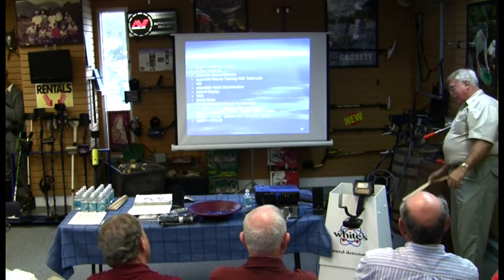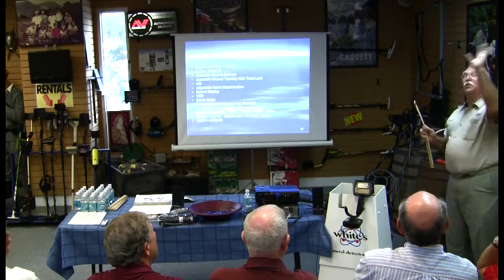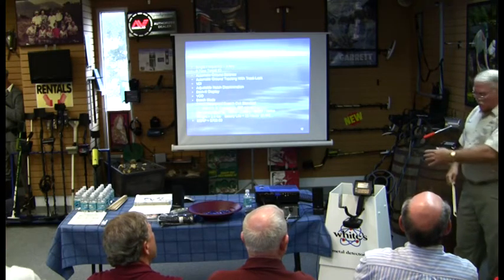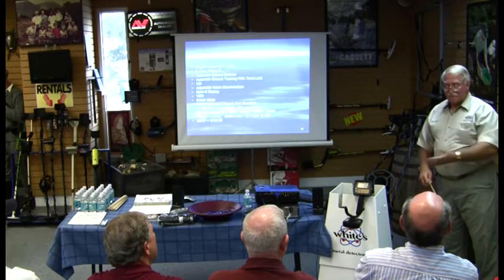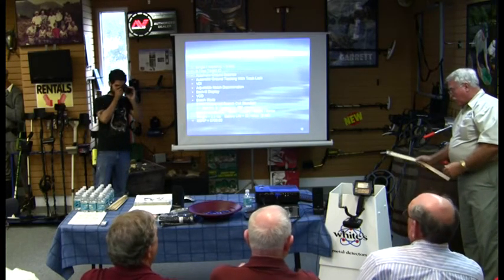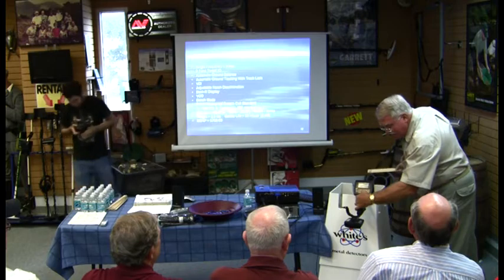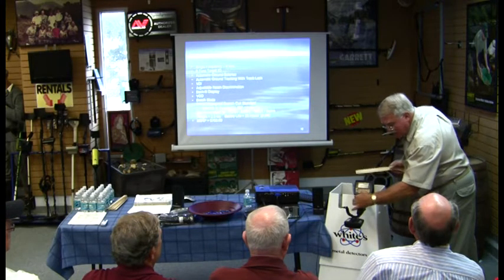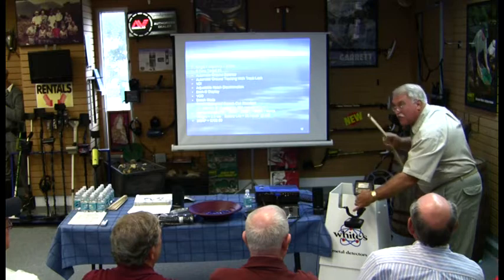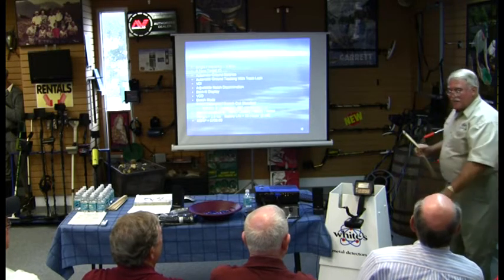See that? Now we're not ground balanced. I've got the track locked. I'm running in beach mode. I'm doing all this to eliminate the EMI. But if you want to know, can you run a single frequency machine quietly in a high EMI environment? Here you are. Okay, so right now, that's a good 8 inches. This is the only machine, when I pinpoint, 8.5 inches. Hear that chatter? That's 60 cycles. That's 9 inches.